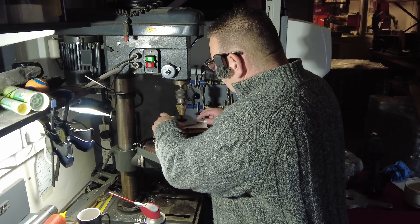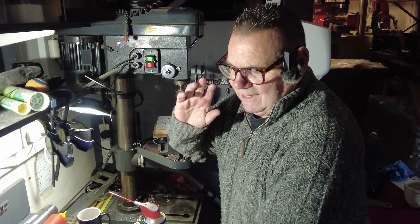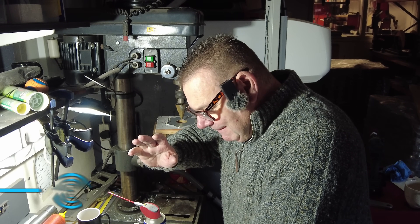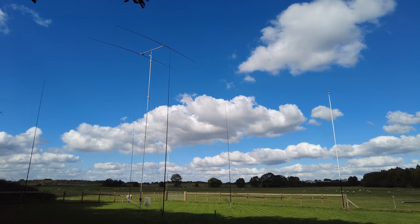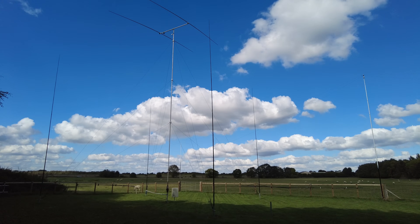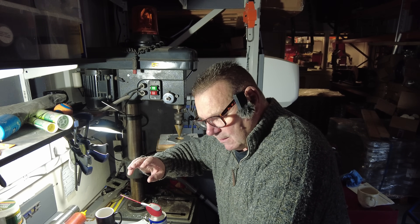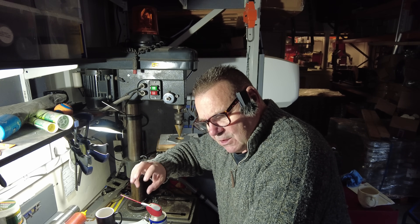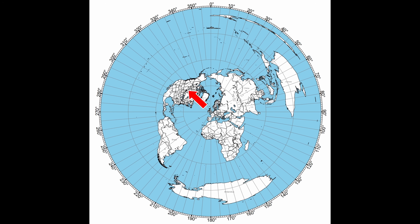I got the four square working and I've got more footage than I know what to do with. Let me explain what a four square is. A 40-meter four square has four verticals set within a foot of the particular dimension — mine are accurate to within six millimeters, a quarter of an inch. If you don't get the exact lengths right it's not going to work properly. You've got four verticals, phasing lines, and a control box, and you can skew or move your pattern like a Yagi in four specific directions.